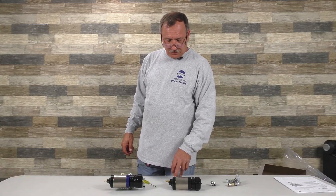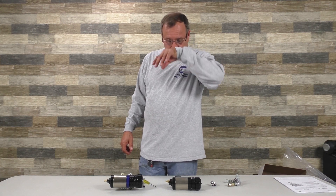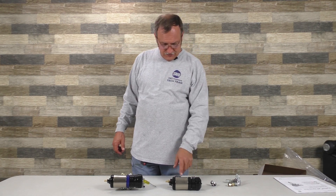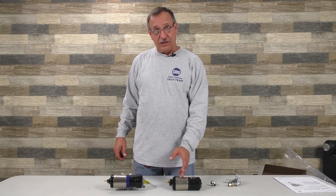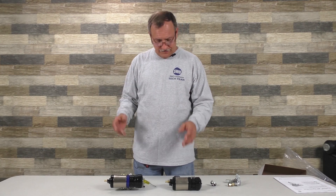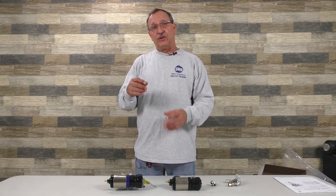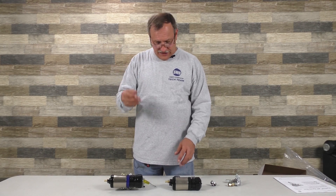On your spool or trigger assembly, there are three little O-rings. When those O-rings become flat, the trigger leaks air. So it gets harder and harder for that piston, because you're losing so much air it doesn't know whether to go forward or back. When you look at an O-ring, make sure it's round, not flat — if it's flat, replace it.